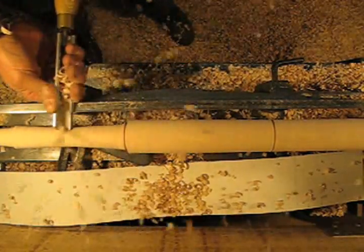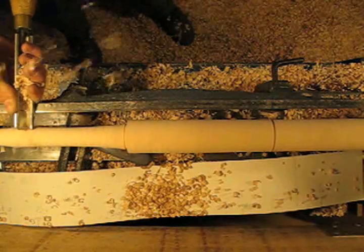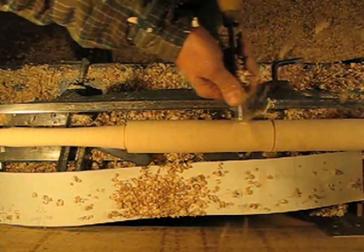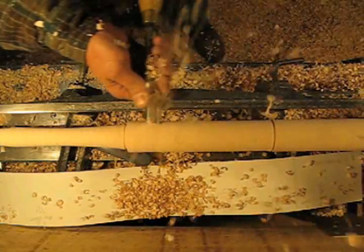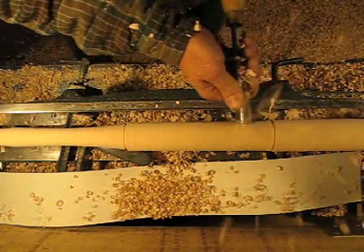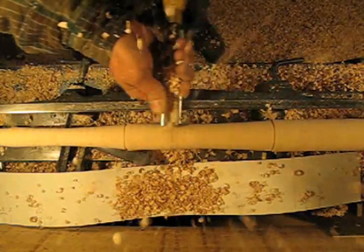You'll notice as I'm cutting this, even though it looks like I'm cutting all the way across, I'm actually lightening up the cut as I come up the uphill side. That way I'm always cutting from a large diameter to a small — or most always. That's really going to help the quality of the cut as well as controlling the tool. While it's still coming down from the cylinder, I'm cutting pretty much both directions, but soon I'll start cutting just one half of the stroke at a time.